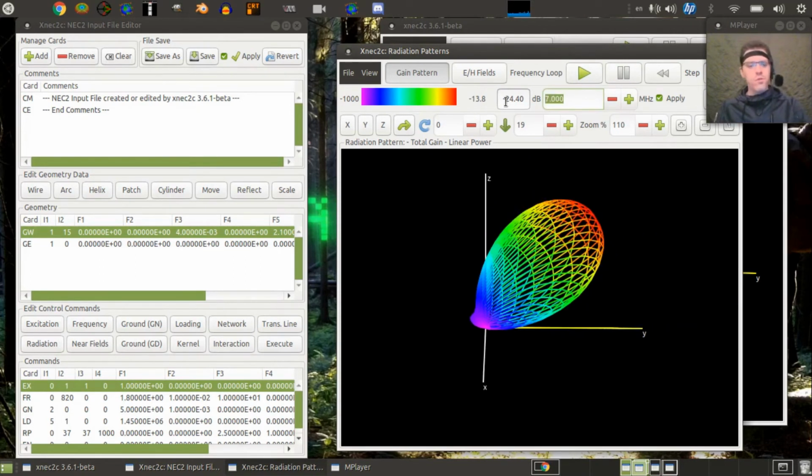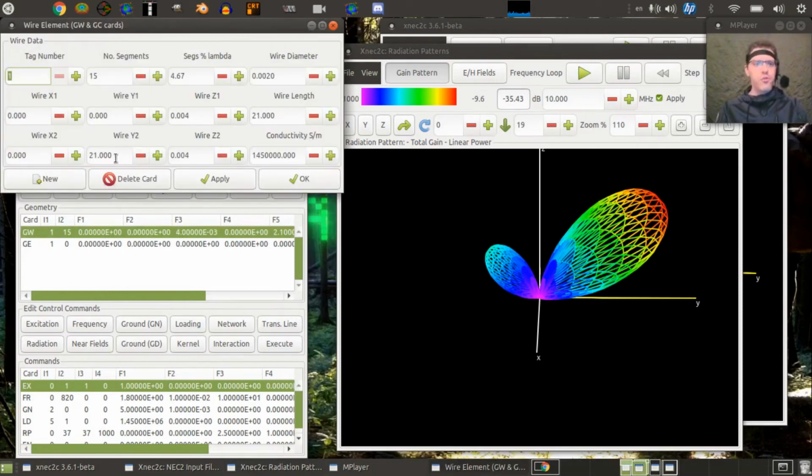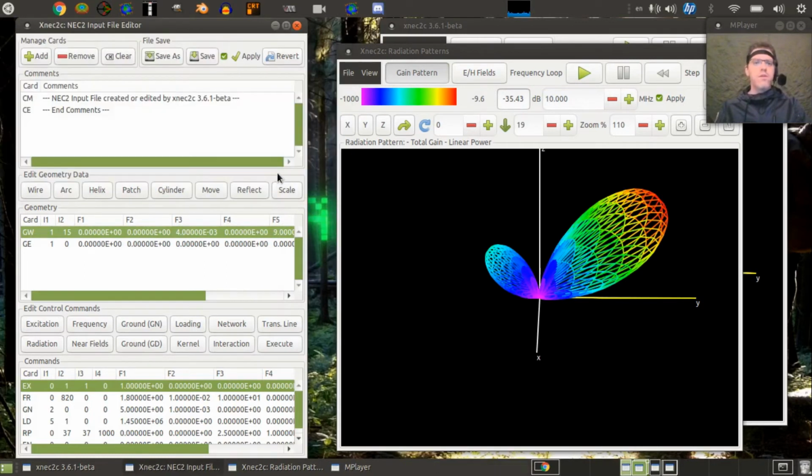And if I want to be able to use the 30-meter band for near vertical incidence skywave around the equator in the middle of the summer, then I would have to have an even shorter antenna. So maybe you could use two links in this antenna or something.